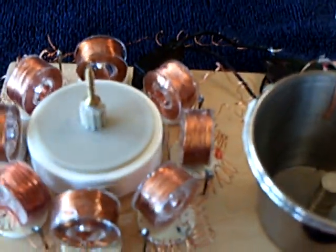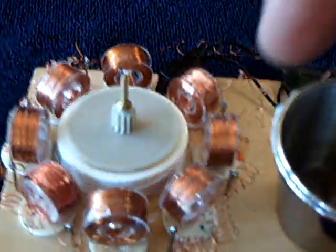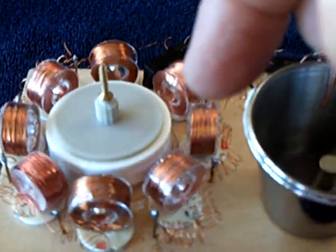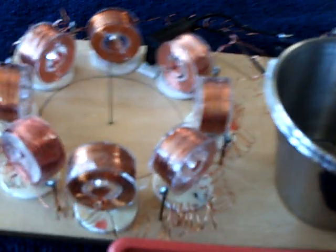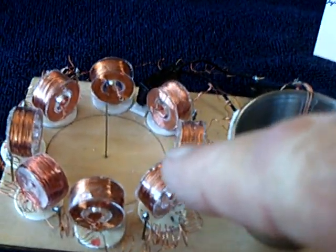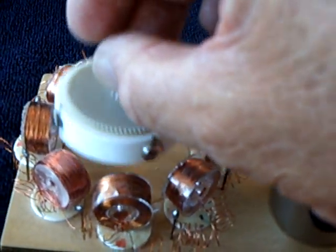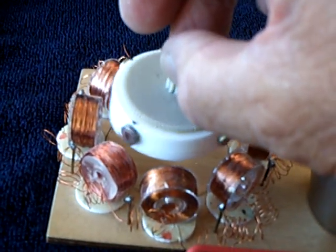This will go again if I just tap it — off it goes again. The pulse motor is eight coils of 30 gauge wire in series, north-south, north-south, north-south. The rotor itself is all north-facing Neos, and it just sits on a needle. This is basically Laser Saber's Easy Spin — just my version of it, with a slightly different bearing.